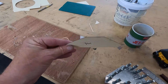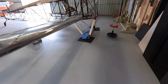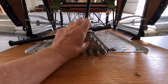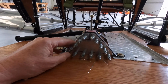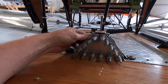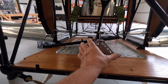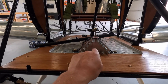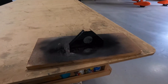Quick cardboard template made up — my bracket with the L-angles. I've had it in there already so it's no surprise, but it fits perfectly in there like that. What I'll do is clean it up, rivet the front, come back and back-drill through the steel — that'll lock it all up nicely. I still need to run an L-angle across the bottom, then that's the best I can do to stiffen that up. Nice lightning hole right in the middle. Spray it black, let's go fly.